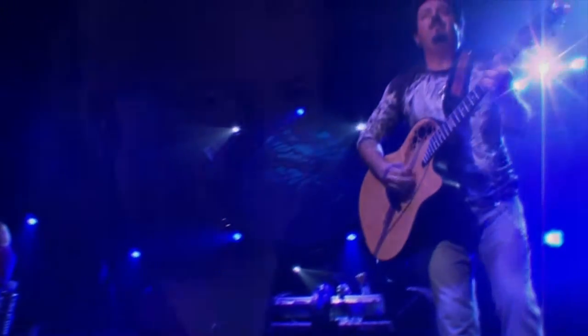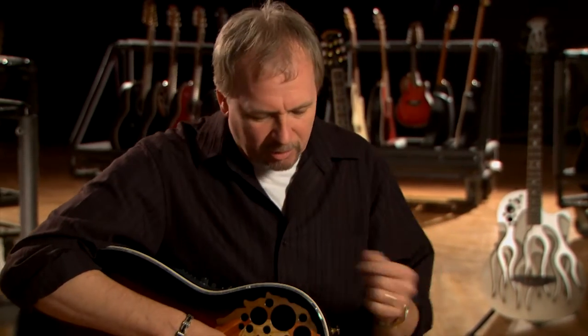We realize the condition that the guitar can arrive at a customer after it's been in an airplane or wherever and going from one continent to another. Normally what we'll do is we'll take the whole finished unit and we will heat it up and we'll freeze it. Anytime we make any kind of a change with Ovation, whether it's a little finish chemical change or an adhesive, it goes through a whole series of environmental tests.